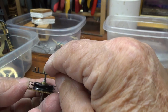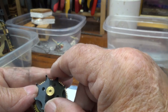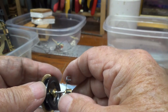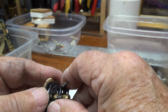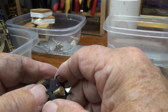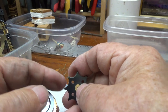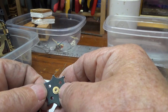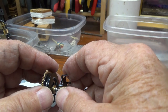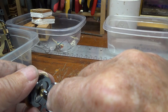Just push on. It had a screw on it that you would tighten up. That way you could adjust it too after you got everything put back together. Now this is a press fit, so if you force this on, that's all there is that holds it. Well, what I'm going to do is I'm going to broach this hole out so that this will slide right on there very easily. And I'm going to drill a hole in the side here